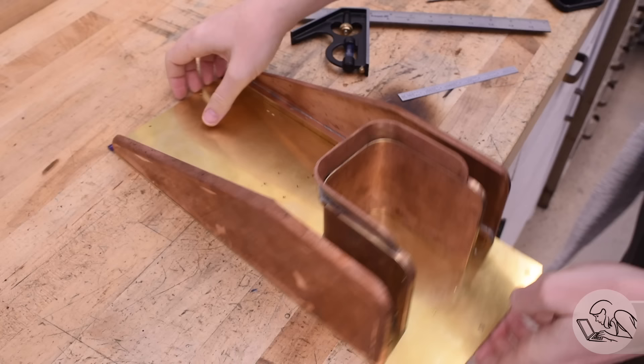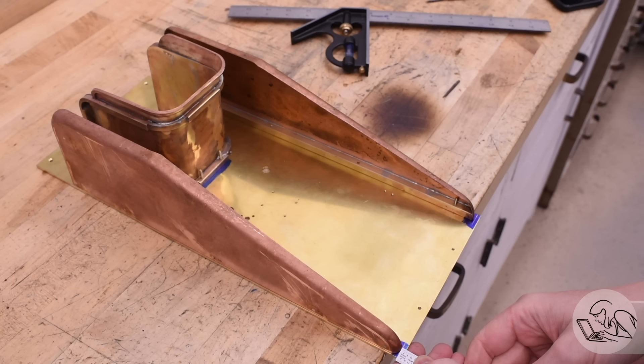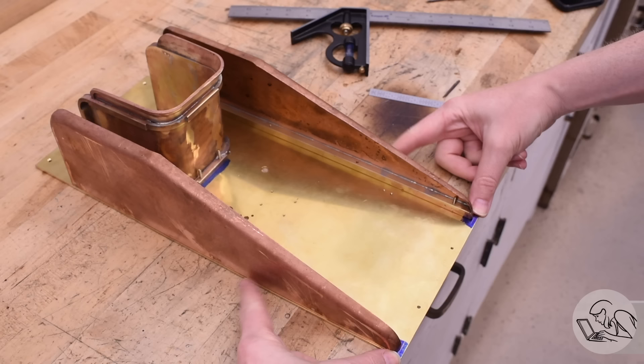There's no way we can make the sheet metal fit around that much error. The first step is to figure out where that error is coming from. I wanted to check the back of the tender sides because maybe the tender sides are simply sitting in the wrong location. The sides are currently lined up with a little bit of a gap at the back, which is actually coincidentally 3/16ths — the same as my error. So that's certainly curious. Maybe my tender sides are simply supposed to move back and be flush with the back of the floor pan.